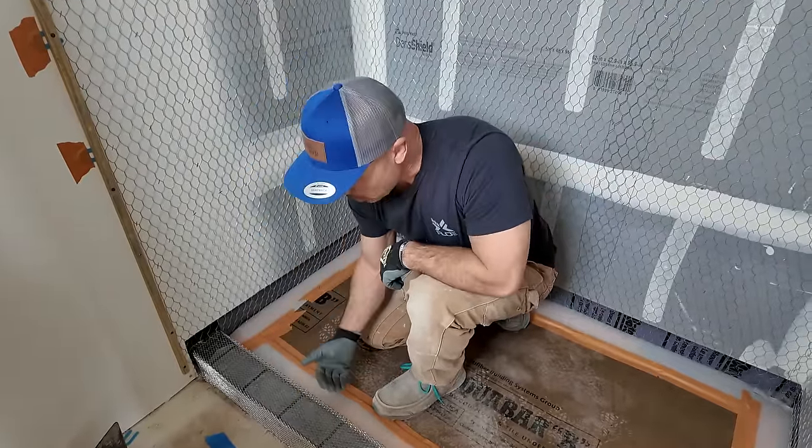Nice thing about two trowels too is it's real easy to switch from left to right. I was going right and I just switched to left. It just seemed to have better finesse with it. Get the right amount of mud on. I definitely think it's easier. If you're learning, try it with two trowels before you jump on the hawk.